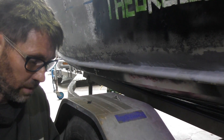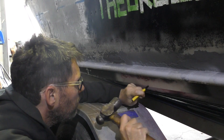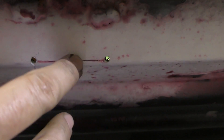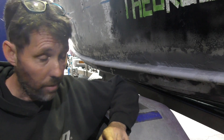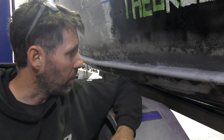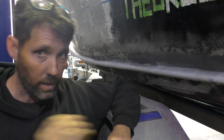What I'm going to do now is drill two small holes — one at each end of the crack — to stop it spreading even further, and then we'll weld it out. This drill bit is just a one or two millimetre drill bit. I'm going to punch a little mark to stop the drill bit wandering. Then I'll clean it all up again — even if that makes the crack harder to see, I know I just have to weld from hole to hole. Because this is much thinner metal, I'm going to turn the amps way down compared to the demo on the thick aluminium on the bench.